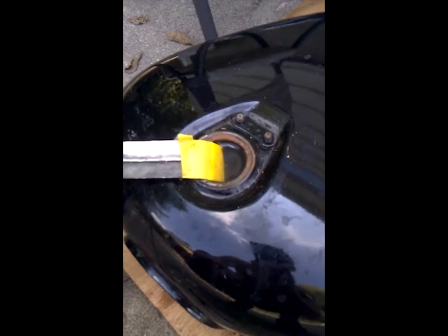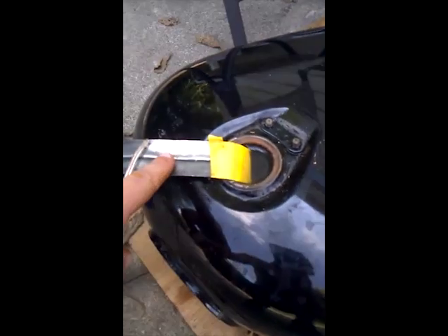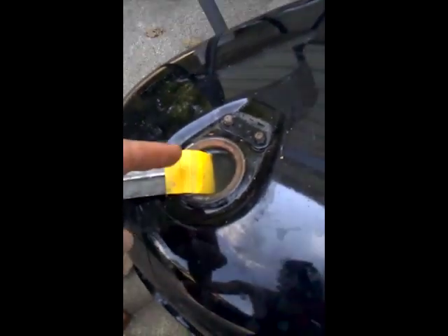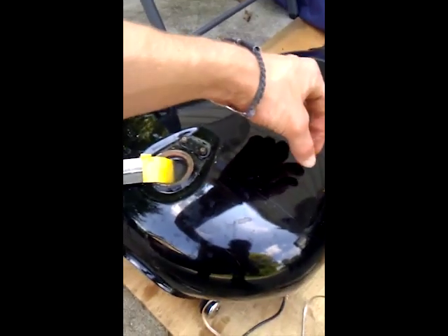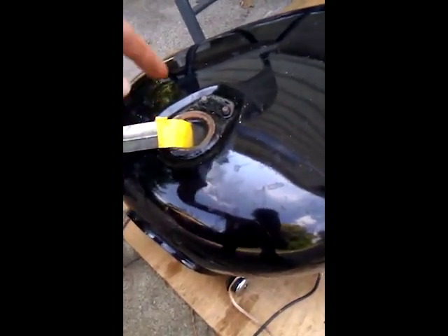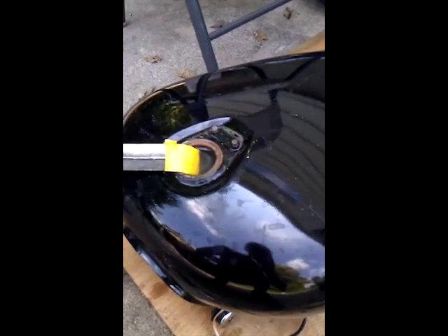I'm using yellow electric tape as an insulator. I can't let the steel touch the tank at all — if I do, it'll short out. So wrap up any place where the steel would be touching the tank. The tip of the steel is in there somewhere and it's bound up too so it can rest easily. I don't have to worry about keeping it exactly not touching anything inside; it'll just insulate the tips that do touch.